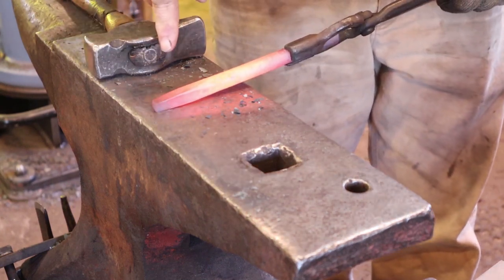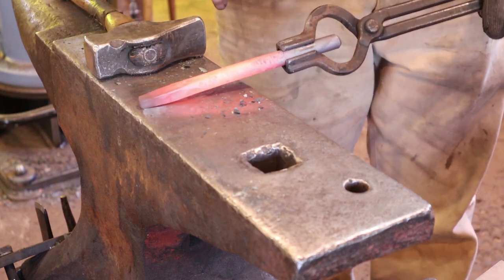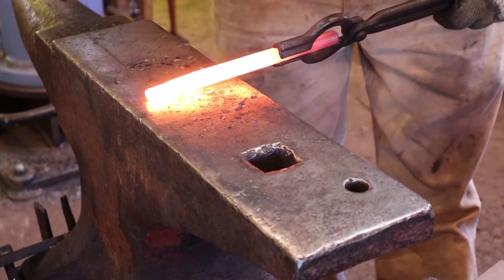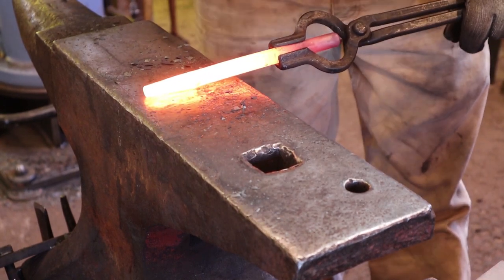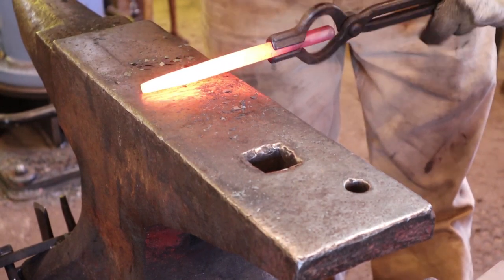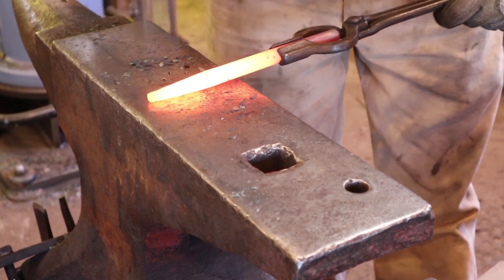The S7 does not work well cold as it cools down to this range — you've got to get it hot again. Any hardenable steel is a lot harder to work and a lot more susceptible to stress damage if you work it at a low heat. But steels like S7 and H13 really need much higher heats for forging.